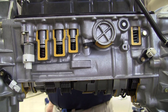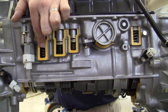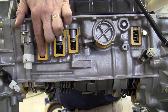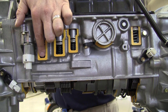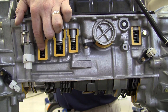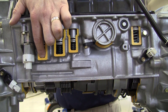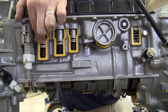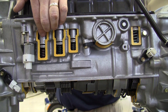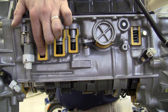There's a valve in the valve body called an accumulator valve that controls fluid pressure back here with the spring. If we have low fluid pressure the spring gives us a soft shift. But at wide open throttle we don't want a soft shift. You can't turn off the accumulator - the piston and spring are still there - so what they do is hydrostatically lock it in place. They fill the passage full of fluid and block it off, which holds the piston solid. That's like turning off the accumulator piston. So you get a nice solid shift. That fluid pressure is variable: wide open throttle it's really hard, half throttle somewhere in between, and light throttle barely any fluid pressure at all.